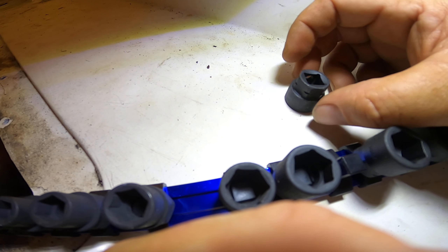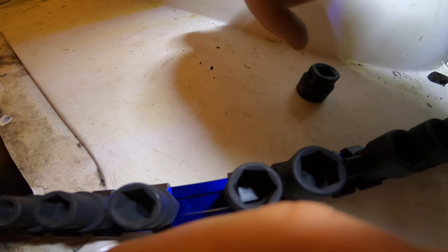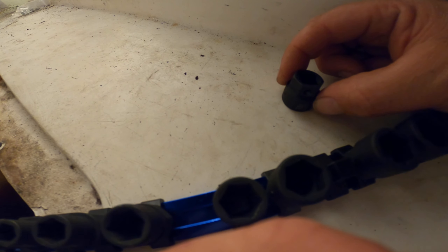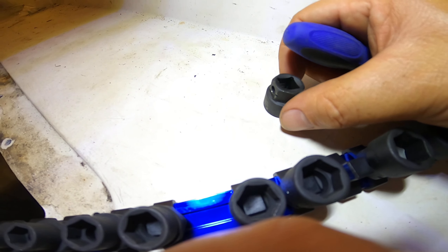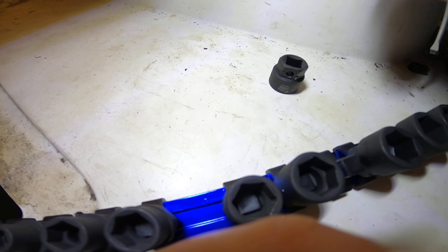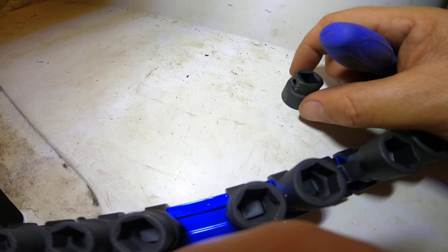We were only able to turn about a quarter of a turn each time. Pull it off, rotate a little bit, put it back on, turn a little bit — did that for a while till it got a little loose. Then we lined it up with this hole so we could stick a screwdriver in the side and turn it, maybe a quarter turn each time. We used a little precision screwdriver, being careful not to bend it. And of course, used some PB Blaster to soak it overnight to get it loosened up. That's the most painful part by far.